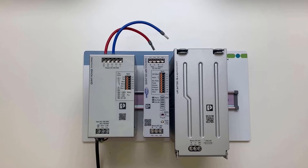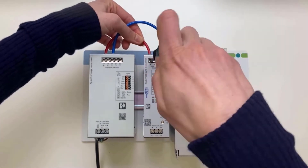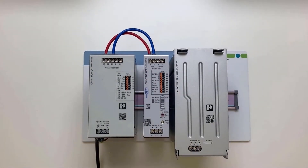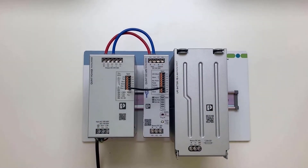In the first step, please connect the 24 volts from the power supply to the input terminals of the UPS. When used with the QUINT POWER power supply, the signal input of the UPS PSBoost 3.7 should be wired to the boost signal 3.6 of the power supply to ensure optimum charging performance of the UPS. Also, the reference potential signal ground should be connected between the power supply and UPS.